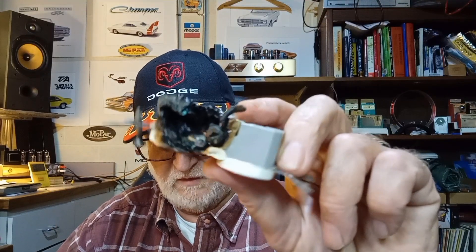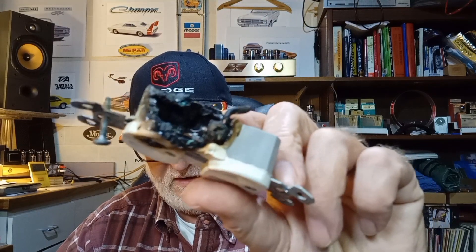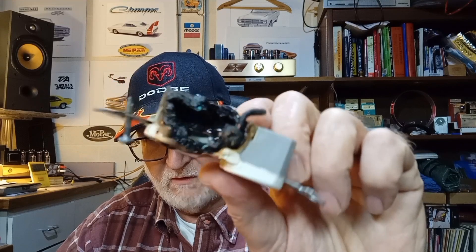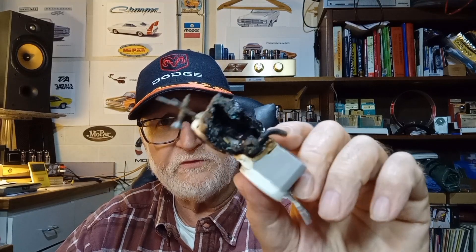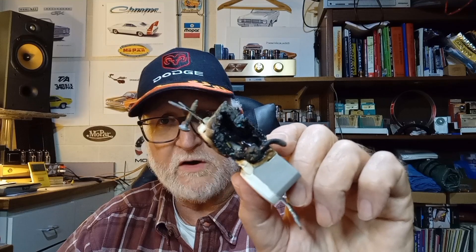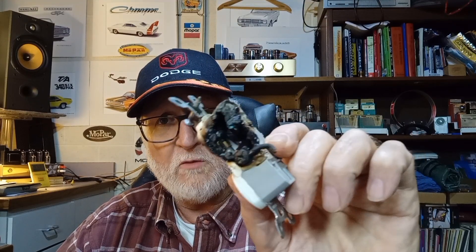The interesting thing in this house was the breaker panel. This is number 14 wire, and they had 20-amp breakers on it — so there was no chance of that ever tripping. This outlet could have caught fire, and if it wasn't for the electrical box it might have. The breaker did not trip because it was the wrong size. Newer arc-fault breakers required in newer homes can sense an arc when wiring is burning and will trip — where a normal breaker won't do that.